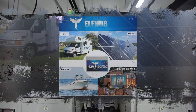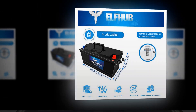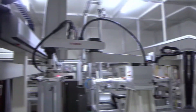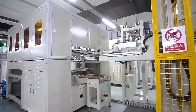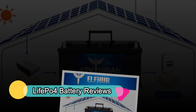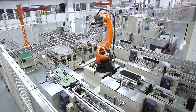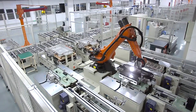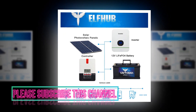But that's selling it short. The TL431 is a full-fledged IC with a precision voltage level reference, a comparator, and an active transistor all bundled up inside. The ability to put different voltages on the reference pin and the cathode make it interesting. Connect an LED and a current limiting resistor up to the cathode and ground the anode of the TL431 — when the voltage on the reference is higher than 2.5V, the LED will light up brightly. You can add a voltage divider to increase the threshold to any value above 2.5V. Shown here is an LED that only lights up when the input is 5V or greater. You can use this idea anywhere you need a voltage-activated switch.